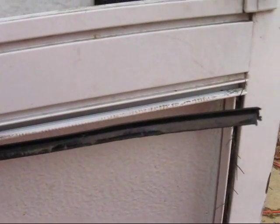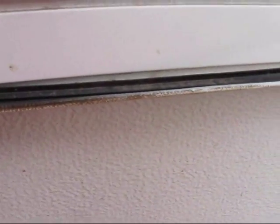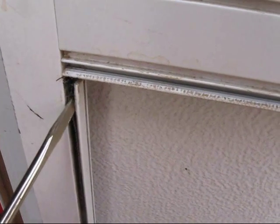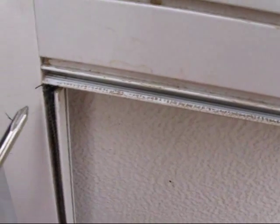I tore the screen out and then there's the rubber stripping stuff. If I clean it up I'll never know how it goes back in. I would use new but I don't have any — I had some, I don't know where I put it — so I'm just going to recycle this one and use it again. I have a screen door tool that has a concave edge that, once I get the screen cut and put back in here, I can just ride the tool along the edge to pop it all back in. To get it out, I'm using a flat head screwdriver and a Phillips.